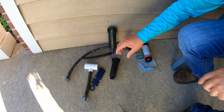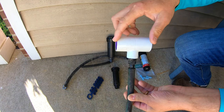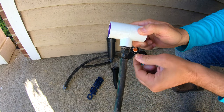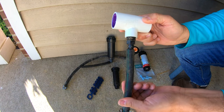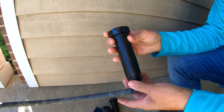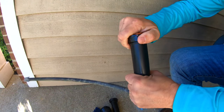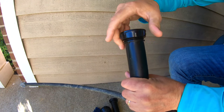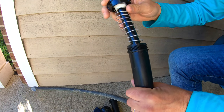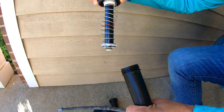This is the makeup of your sprinkler system. You have your main PVC trunk line — it's rigid, it goes in this direction — and off of that are fittings with a smaller, more flexible pipe, and these go to each of your sprinkler heads. When your sprinkler heads are buried, you just clear away the dirt from the top, unscrew the internals, pull it out, and replace them. That's if your damage is limited to the top portion of the sprinkler head.